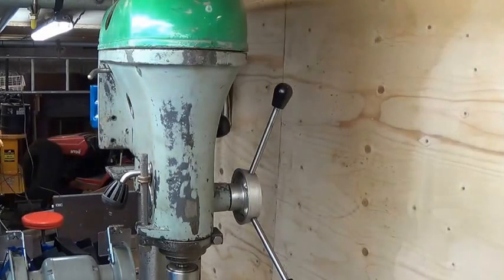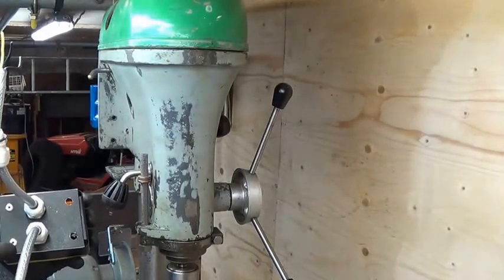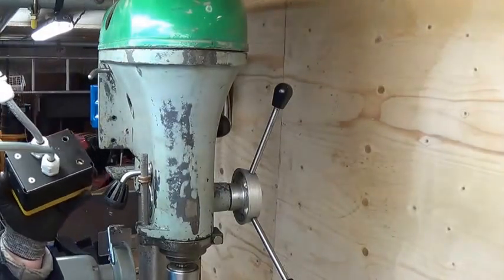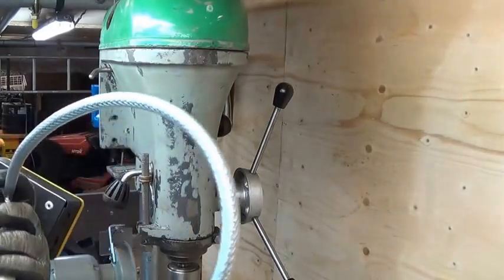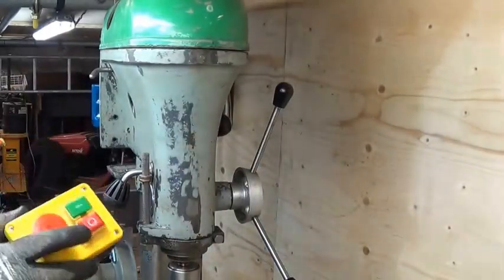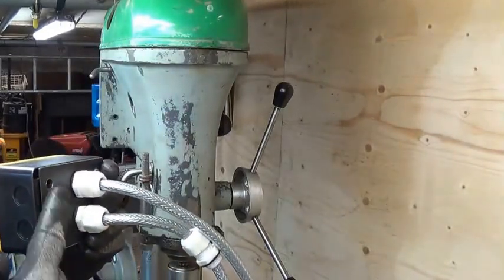This isn't the prototype box — this is the actual box. I've mounted a metal plate on the back, riveted on, and I've cut two holes and put the cabling in. There's a cable that goes to the motor and a cable that goes to a 13-amp plug, because it doesn't draw very much current. I've used SY cable — it's steel wire armoured but still flexible. The box is mounted on the metal plate, which also has two holes drilled in the side — I think they're M6.